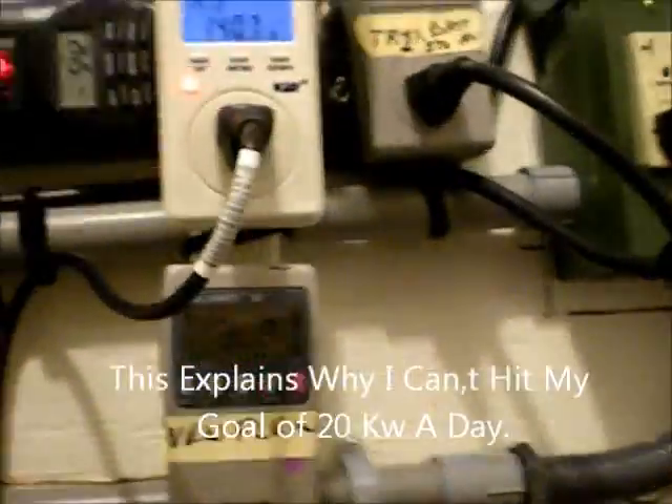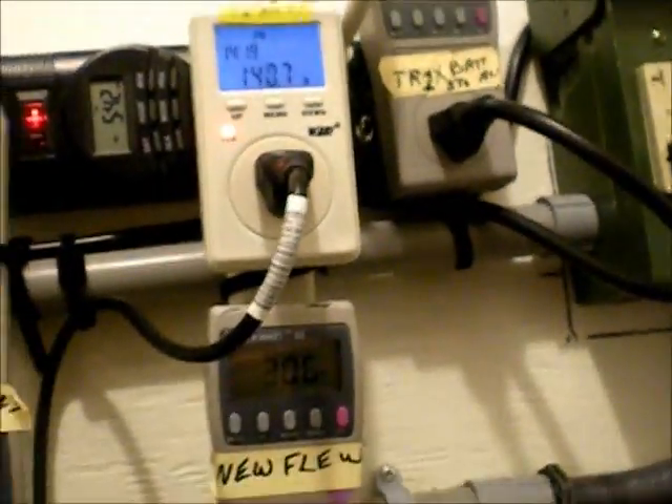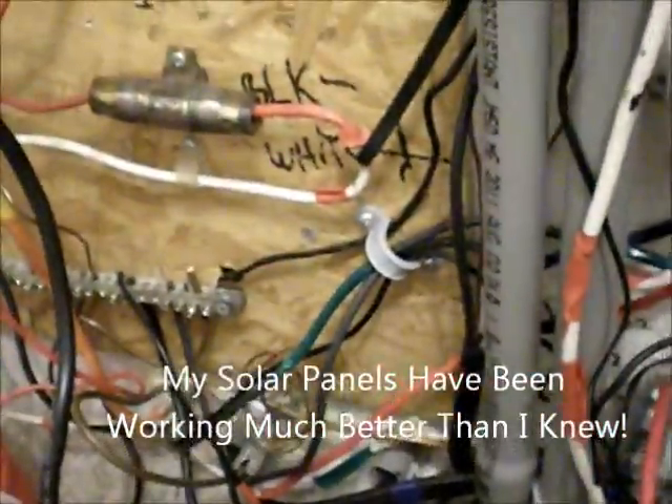Anyway, I made the test: 308 and 179, and that's a big improvement. I also got an improvement when I added an extra ground, which is what this is — it's a red wire with black tape on it. I'm going directly down to my ground bus, which goes to a number 4 rod, to an 8-foot rod in the ground.